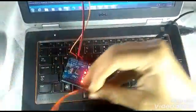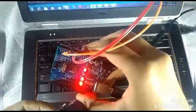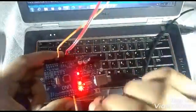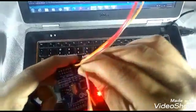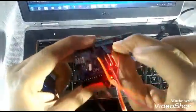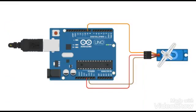So now this is the code I have here. So what I'm going to do is put the servo motor on. You can see my servo motor. It comes with 3 wires, the red, brown and orange. So red goes to the plus, and brown goes to the ground pin. So I wired the servo. You can see the diagram in the next screen.